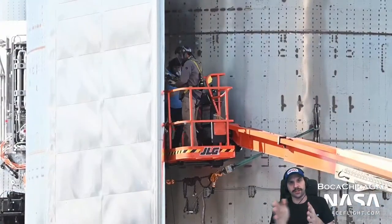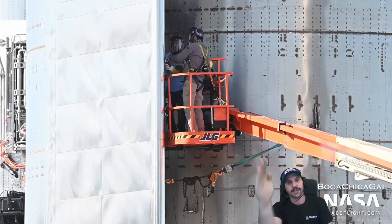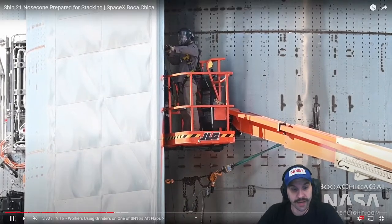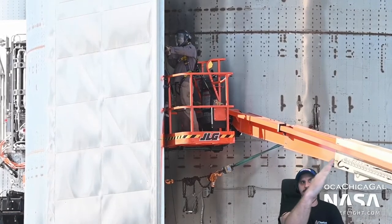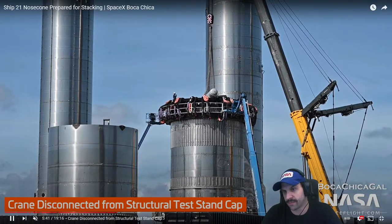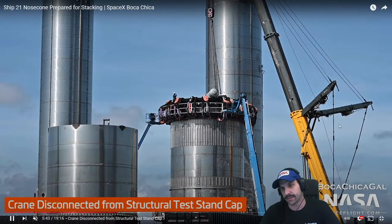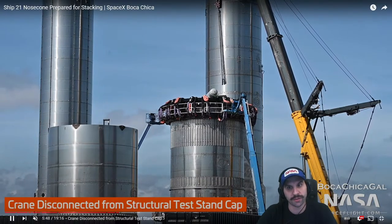Because you have a telescoping crane, it's one single telescope. If it's too long, it's gonna deflect. You do not want deflection with a crane. That's why cranes can't pick up in the wind. You try to pick up, the wind takes the thing and tips the crane over. These retractable arms on the side triangulate it and basically turn the boom into a giant trestle.